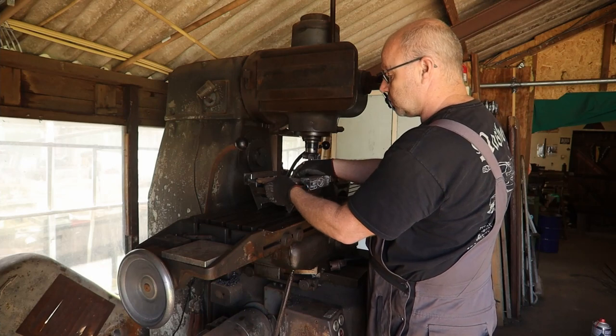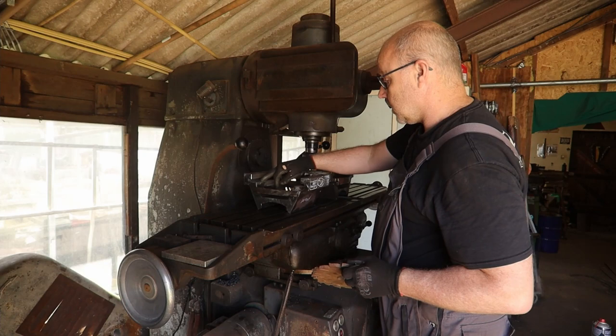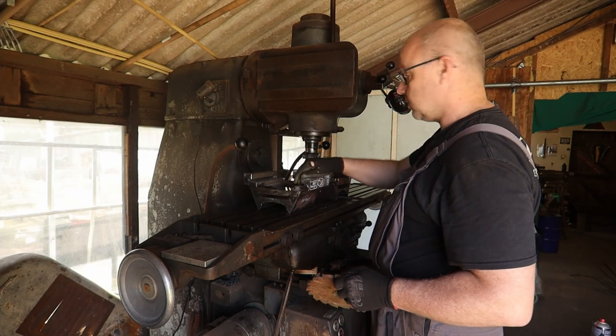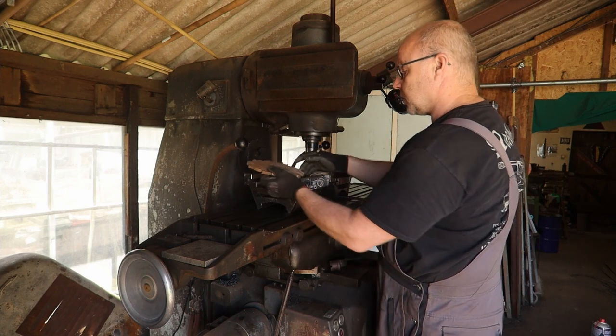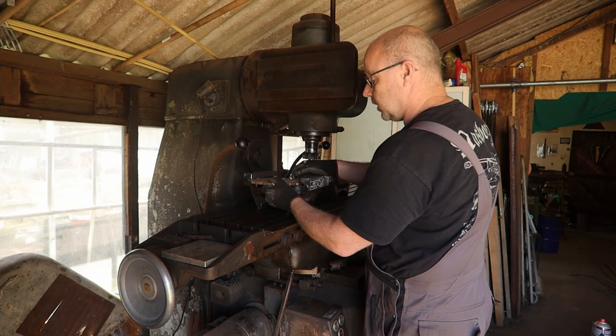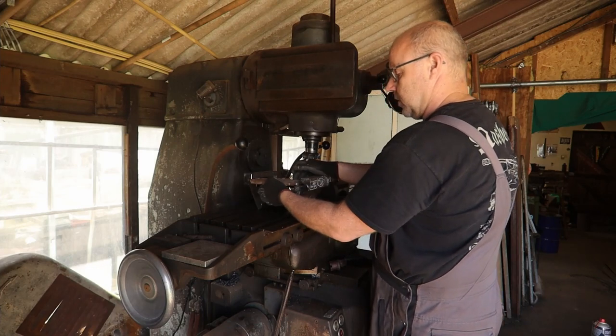See, it's not fitting at the moment, but I think with this mill also take a little bit down so that the depth is correct, because with this mill it's easier than with this one. And then I can use this one to just touch off and then mill into the side and create a pocket large enough and deep enough.